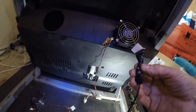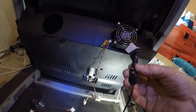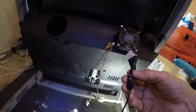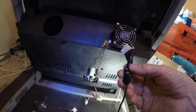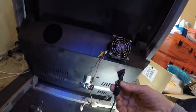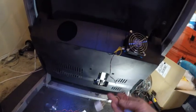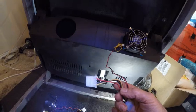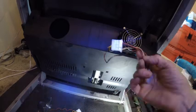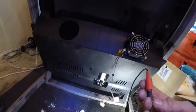The computer must send it a signal or even the power actually through the yellow, because it's directly connected to the red. In this particular fan, I connected the two blacks together for ground and the yellow and the red together to power this fan, because it wouldn't turn on otherwise. You can sort of figure out what you need to do for your specific fan.